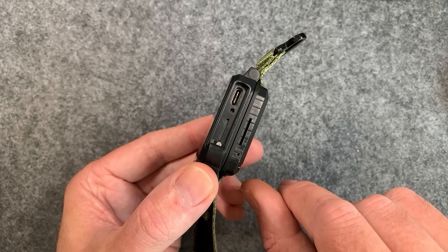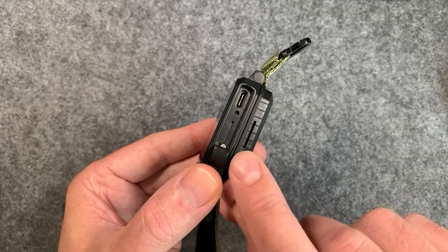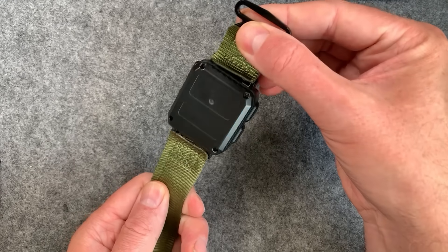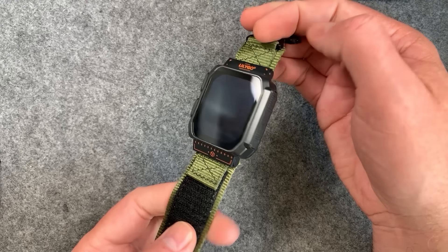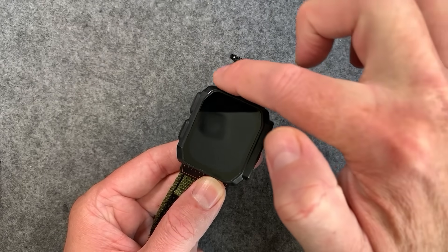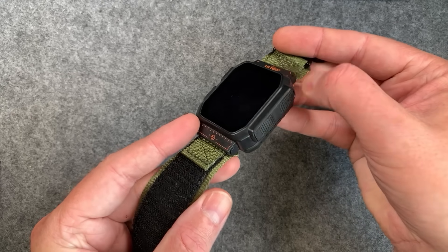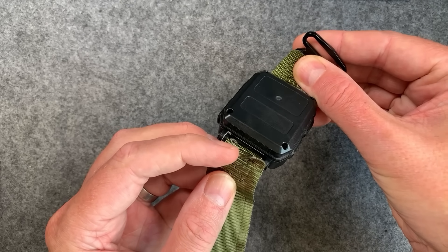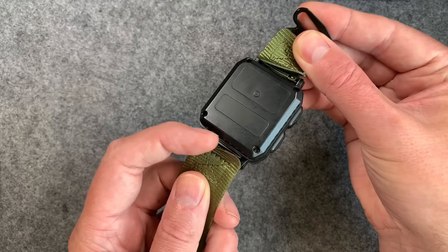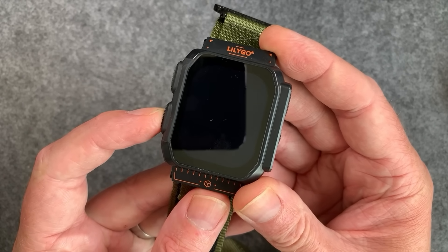There's a micro SD card slot for maps, your ID, and all other settings stored on SD card for MeshCore. There's also an opening for a speaker — I believe it's a water-resistant speaker behind there. The bottom has four screws; take them off and the back comes off, easy to service. Interestingly, the antennas are underneath the LilyGo logo — the GPS antenna is there, and the LoRa antenna is at the bottom — they've printed a metallic antenna trace onto the plastic case.